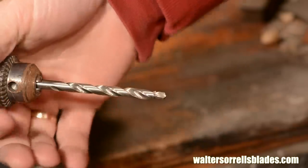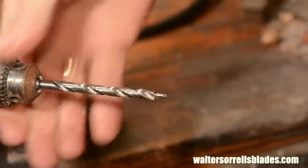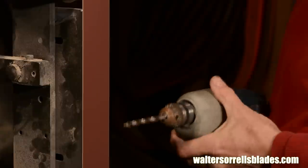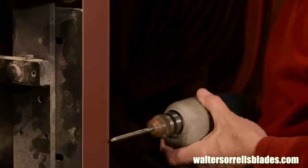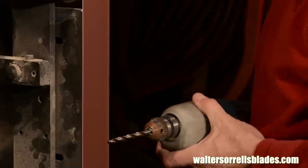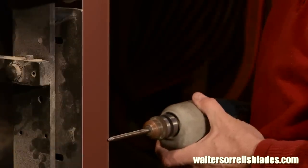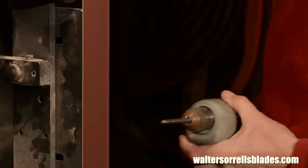Method 2. Drill and twiddle. In this approach, we'll put the drill bit in a hand drill and run the hand drill against the belt. Concentricity problem solved, and it's easier to make the smaller piece run parallel and get a consistent diameter. However, getting it to the exact correct diameter without overshoot could be a pain, and we still have a problem with the shelf thing where we transition diameters. Yuck, still no good.